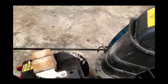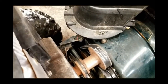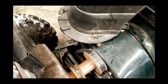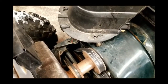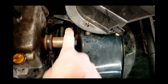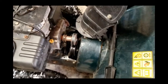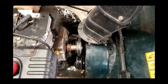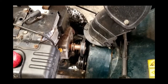When you engage that lever, the pulley on the engine is always spinning, but the pulley on the auger isn't turning because the augers are frozen or seized or stuck. So your engine pulley up top just keeps spinning and it burns away at that belt. I'm going to add on to this little video a demonstration of what happens when your augers don't turn and your engine pulley is spinning.